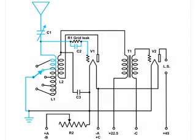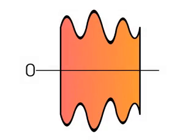This picture shows the tuning in this radio. C1 and L1 are the tuning units, and depending on where they're set, they bring in different parts of the AM band. That energy is picked off just under C1 and travels through C2 onto the grid of V1. This is what the antenna has brought in, transferred to the grid of V1. The carrier is the colored part, and the information we're interested in — the audio — is the wiggly lines at the top and bottom.